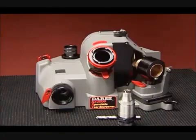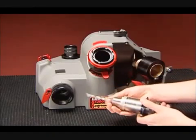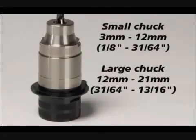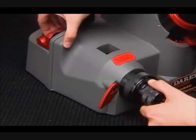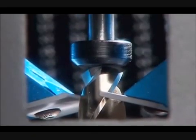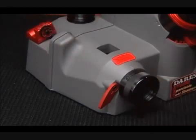Step 1: Alignment. Insert the drill into the chuck and tighten the chuck knob just to the point where the drill slides in and out. If the drill is held too tightly, it won't align properly. Use the appropriate chuck for the size of the drill being sharpened — the drill diameter ranges are marked on the chuck cam. Align the chuck dog with the notch on the alignment port and insert the chuck. Slowly squeeze the red slide handle until it touches the casting. Then look at your drill and make sure the drill tip is touching the pusher shaft cap and that the pawl arms are holding the drill across the flutes — this setting determines the relief angle. Then firmly tighten the chuck knob, release the red slide handle, and remove the chuck.